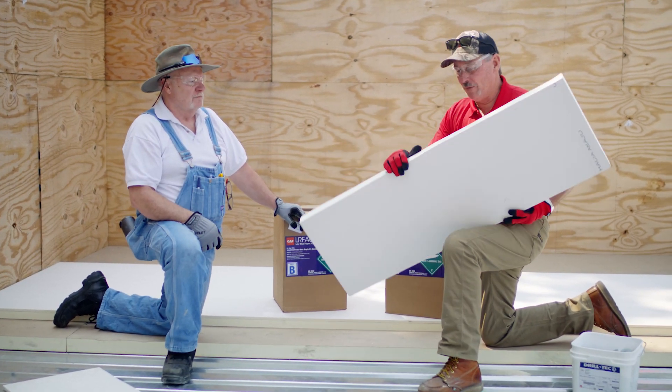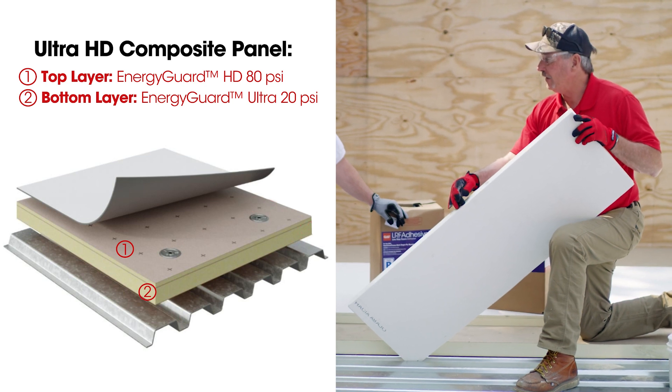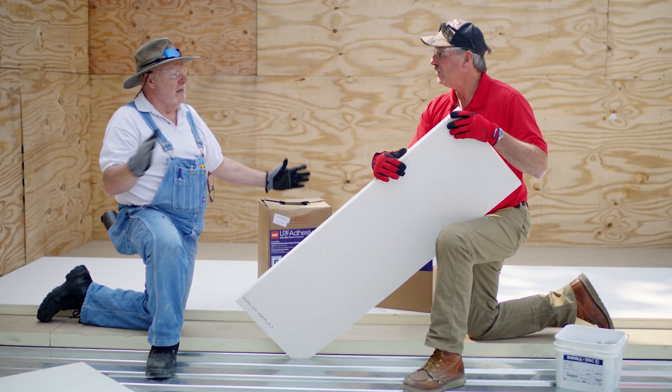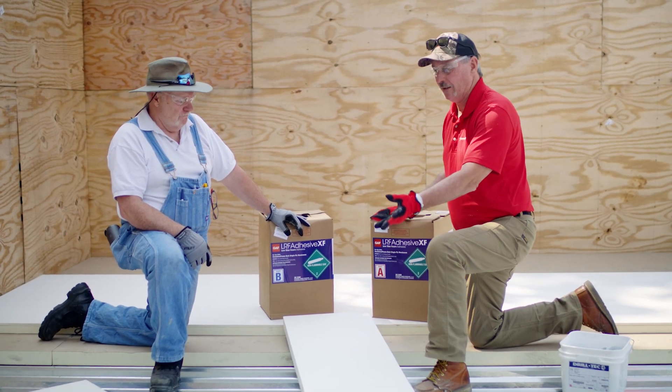So we have a piece of half-inch laminated to what's probably two inch. We can get different sizes in thickness and in boards — four by four or four by eight. A lot of contractors, when they're doing a job and need a cover board, are using a gypsum type material cover board.